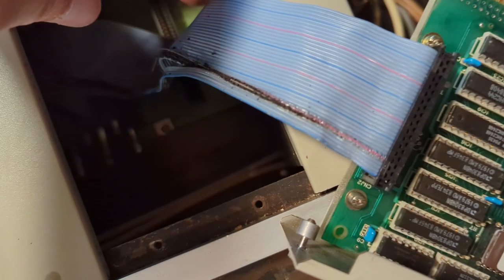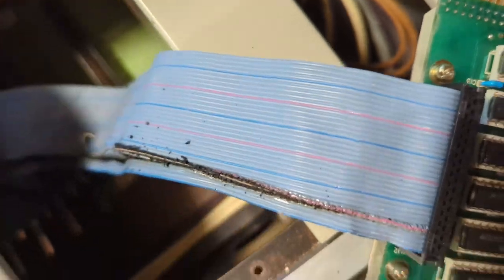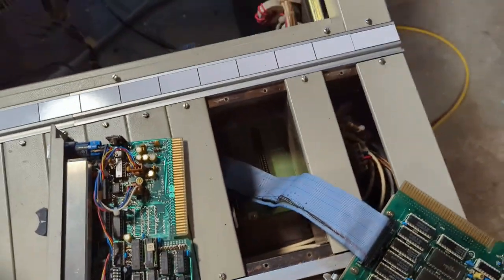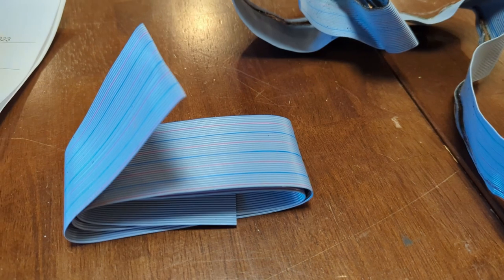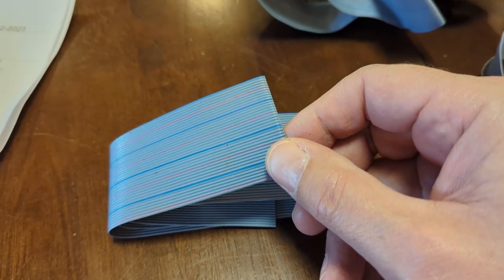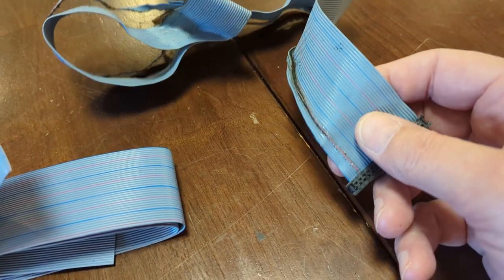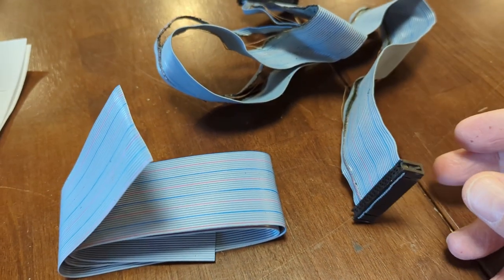It's the computer-assisted faders — this ribbon cable started burning, right up there. That's where all the smoke was coming from. So now I've got to figure out why, but I can just leave this out for the moment. Overall, that's good news. I tracked down an electronics store in Chemainus, just 20 minutes away, and went there with the wrecked cable. He had the same type of cable — still in a package that said Tandy Electronics, which is pre-Radio Shack. It's pretty much the same type of cable, so I'm going to put the ends on it and try it out. I hope it works.